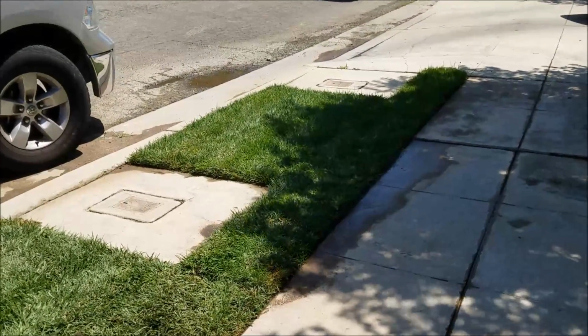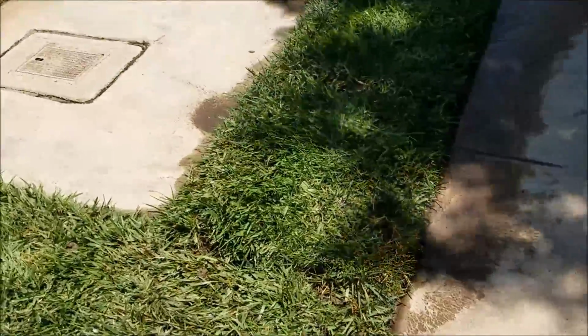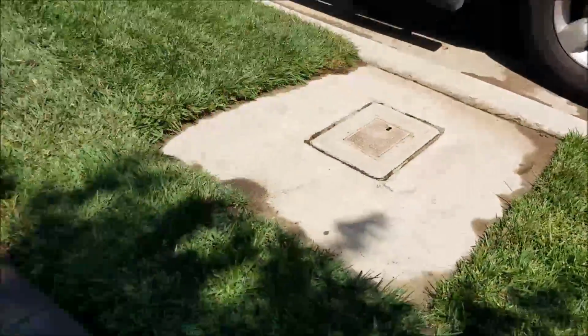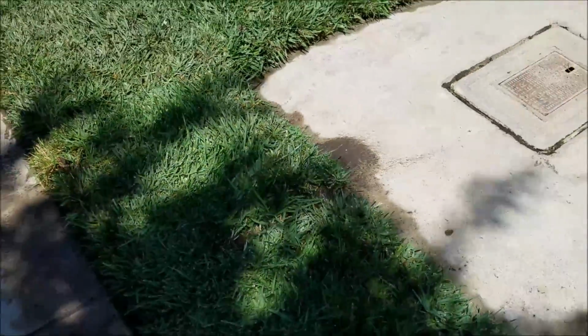We tested it, we backfilled it with about 180 pounds of gravel, and then put the dirt back in there. You can see it's kind of a big mound right now, and the reason why is the dirt is so saturated from the water that's been leaking for a long time that it's just a big mush factory right there. So don't step on it for a little bit. When you do get ready, you can see the grass. Maybe you can't because I'm moving the camera. But when you move it, the dirt just kind of mushes around.